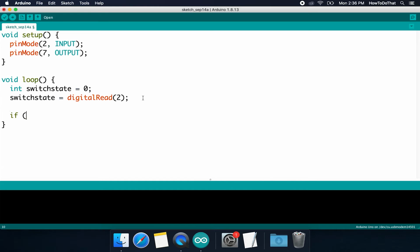So the first thing I want to do is ask, hey, is my switchState equal to LOW, which means the button is not pressed? Notice that I used 2 equal signs here, and the reason is because a single equal sign sets a variable value. So I am setting switchState to equal the value returned from digitalRead. But in this case, I don't want to set switchState equal to LOW. I want to know if it is LOW. So the way you do that is by using 2 equal signs in order to ask, hey, compare this to this. If they're equal, then that means it's true. So that would mean before anybody's pressed the button, before anybody's closed that switch, this will equal true. And because that equals true, anything that we type in these curly braces here will be executed. So it will actually be performed on the board.